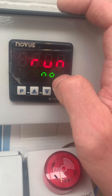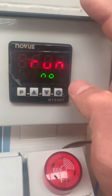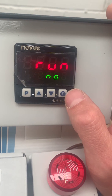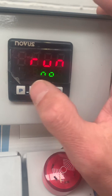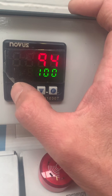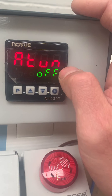Run is currently set to No, but normally when you first switch the controller on it will be in Run. You can also set these timers up to work from the F key — so rather than cycling through the menus, a single press of the F key will trigger the process. We'll get to that shortly. That covers the operator menu.